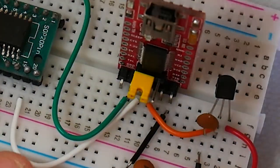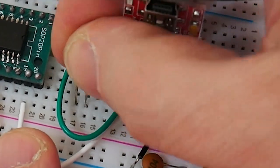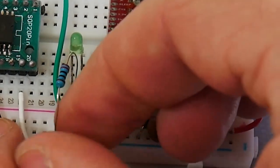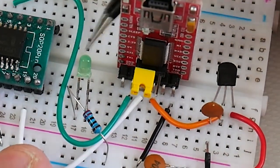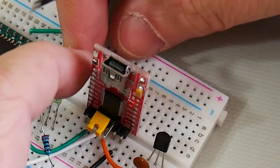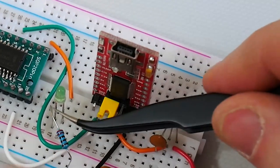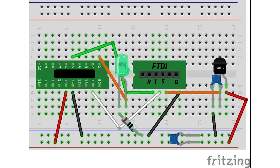I've got an LED here — stick it into two pin holes with the longer leg on the right. Then connect a resistor from the left (shorter) leg straight through to ground. Finally, we need a way to control it: take pin number 1 on the microcontroller and run it through to the positive (longer) leg of the LED. So pin 1 connects through to the LED's positive leg, then through the LED and resistor to ground. That's our circuit complete.